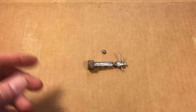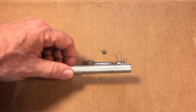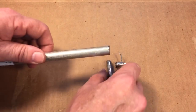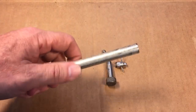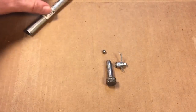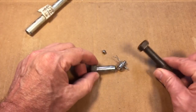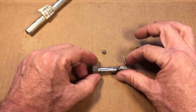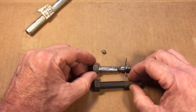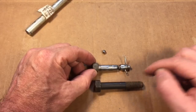Normally, if you had a full-size big lathe, you would take a large piece of steel stock and fabricate the piece out of that. But with a small mini lathe like I have, especially working on steel, taking metal off a big rod is pretty difficult. So what you always do with a mini lathe is start with something as close to the finished product as you can. We're going to start with this bolt — that's so much less material I have to take off.